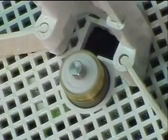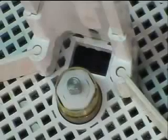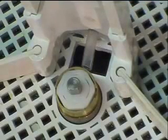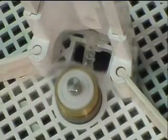If you'd like even more water on the bit, you can route the water supply hose up on top of the table like this. Notice how much water is supplied in this position. If this is too much splash for you, you can always put a sponge in the rectangular hole provided.